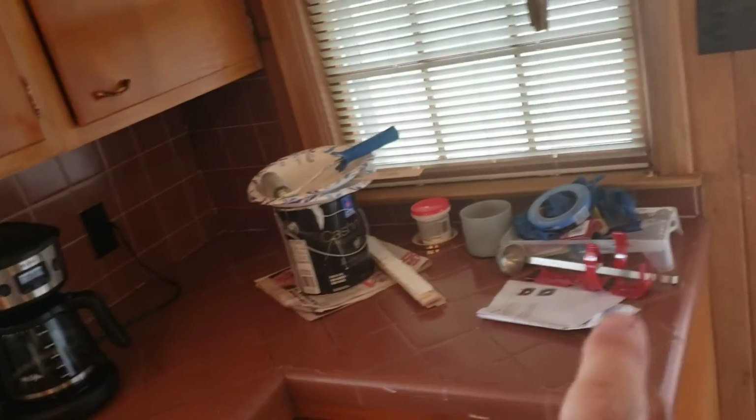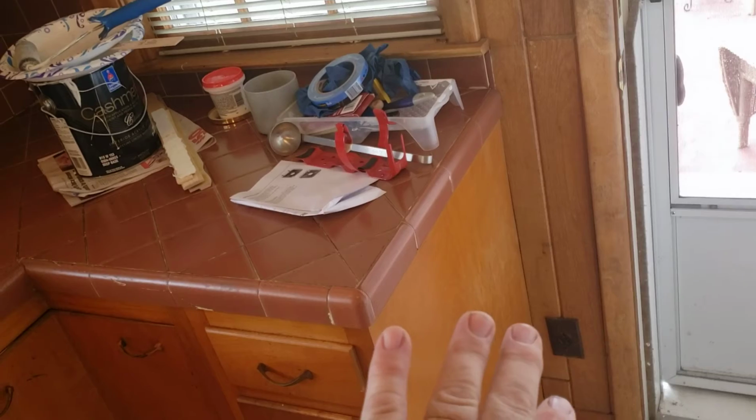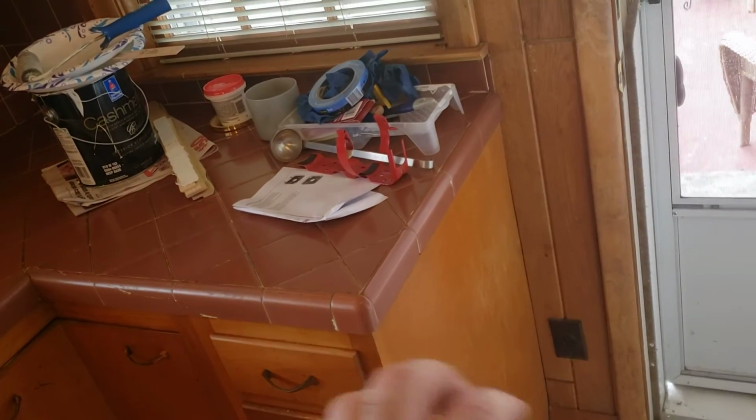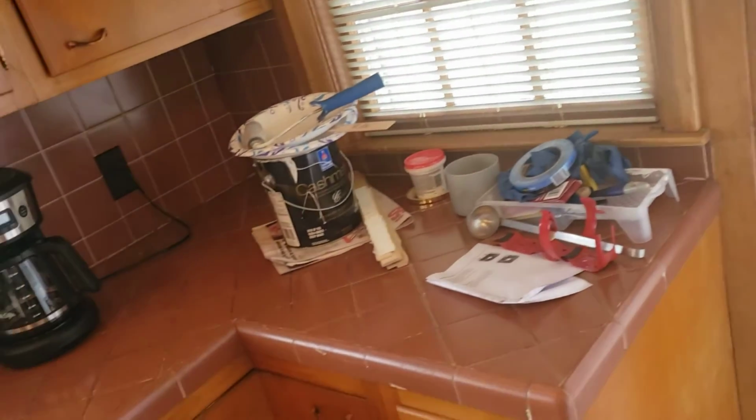Again, low windows, see that window is only 3 inches above that counter space. So again, if we were to bump these cabinets up with an inch of flooring below, or an inch of blocking below them to get even with the floor, that would be only like 1.5 inches left before your window sill. And so you'd have trouble with your countertop fitting under that molding.